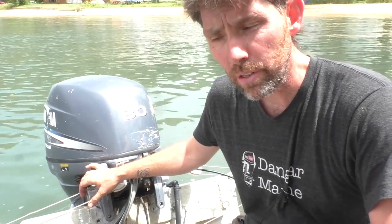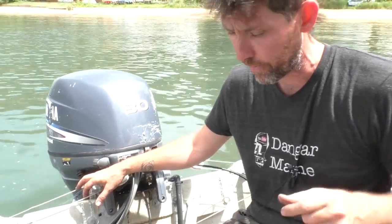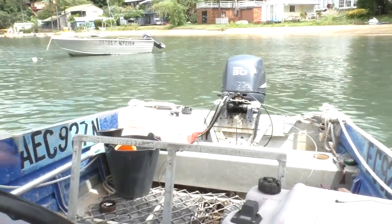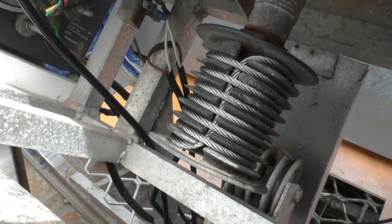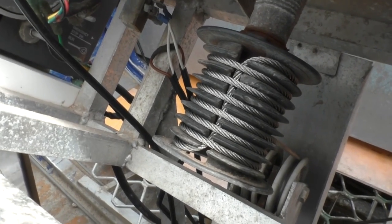Now these wires are reasonably taut, I'm just going to turn the helm a few times and see if any extra slack gets introduced into the system as it moves around. Turning the helm now, it feels nice and smooth and the cables seem to both be holding the tension nicely. I'd popped the tape off earlier — sorry I forgot to mention that — but once it was all tensioned up I could take that tape off without any risk of it springing off the drum.